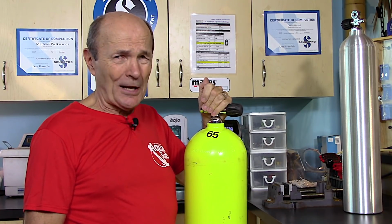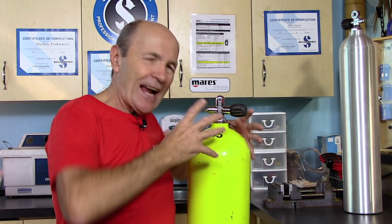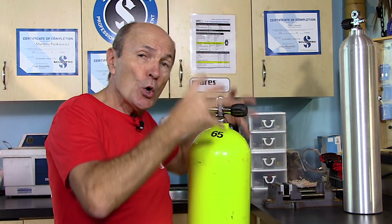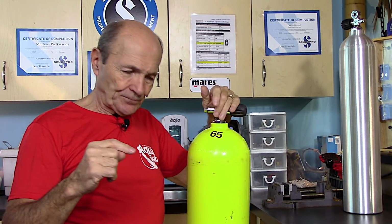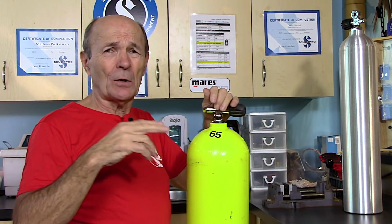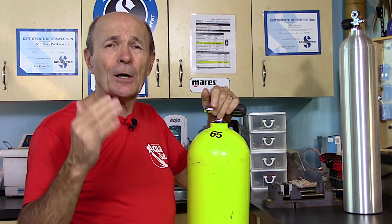and it sure won't be 3,000 PSI when you jump in the cold water, because when you fill the tank, it gets hot. The air gets hot. And then when it cools, the pressure drops, just the way it is. So that's the first disadvantage. The second disadvantage, if you go in and you've got 5 minutes, is that it's hard on the tank.